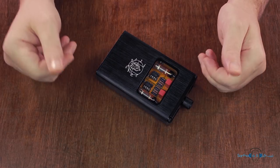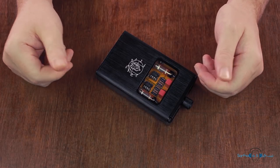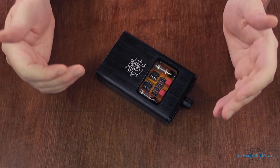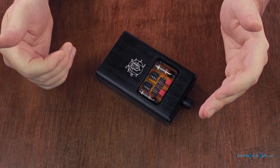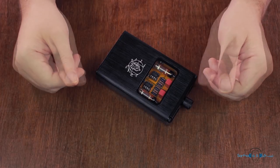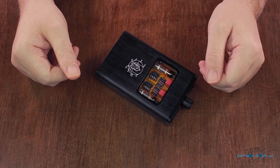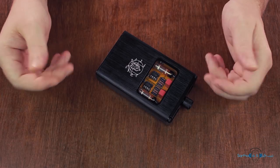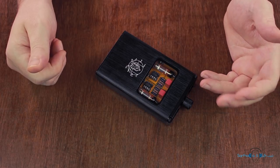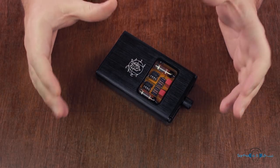That's basically how I would sum up what tube amplifiers do to the audio — it tends to just soften and warm it up a bit, making it more subjectively pleasing. And that's exactly what I'm getting from the B4X. When I switch back and forth between it and the headphone output of my Micro-iDSD Black Label, I can clearly hear that the Black Label sounds cleaner, but the sound from the Little Bear just has a touch of warmth and fullness that I find more natural sounding and ultimately more pleasing. The only annoyance is if you bump the amp that vibration travels into the tubes and you hear a very distinct ringing sound — this also happens every time you plug in your headphones. The tubes are also susceptible to radio interference, so it's best to keep it a foot or more away from a mobile phone.